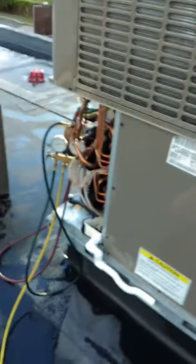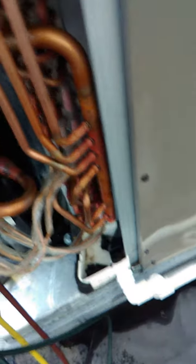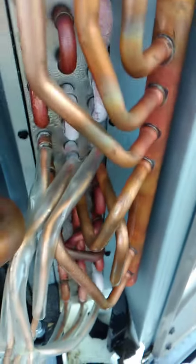I've got some heat on the condenser top here, got some cooling going on down here. The ice just went away on these tubes here — this tells me I'm getting close. Nice and hot up top, cool down below, starting to sweat a little bit. Still seeing a little ice in there — we're just still a little bit too low on the Freon yet. R410A.